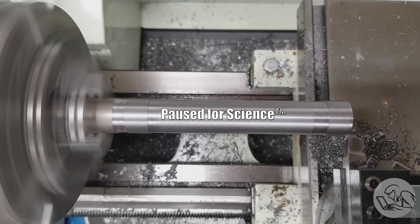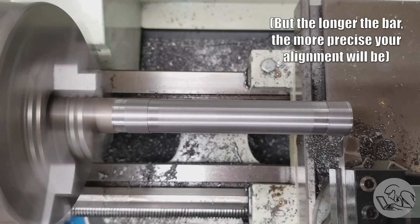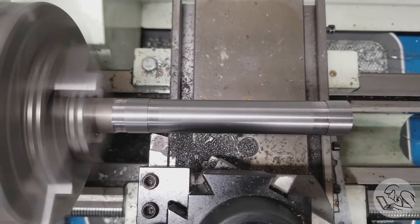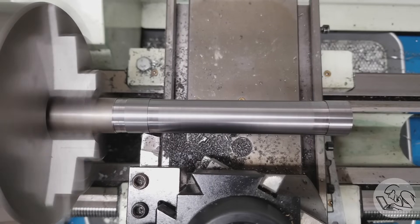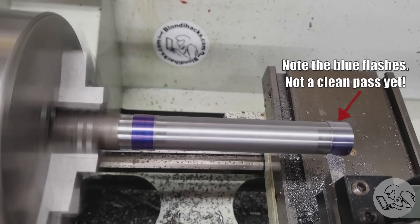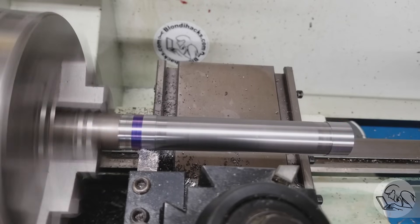The way we get away with this much overhang is cutting very, very light passes — two thousandths at the max. If you get chatter even with a two thou cut, your test bar is a little too long. With a one inch bar and about six inches of overhang, we can do a two thou cut with no chatter. We do a series of two thou passes at each end using power feed for the ends and hand cranking in between. Put some Sharpie marker on there — if after your pass there's no Sharpie marker left, you know it was a full cleanup pass. Once you've got a full cleanup at both ends, you're now measuring the true straightness of the ways.